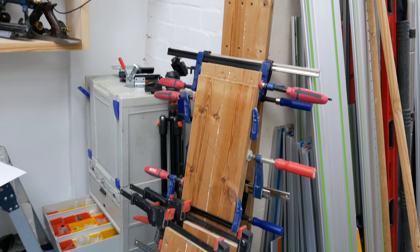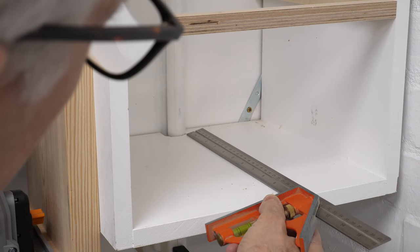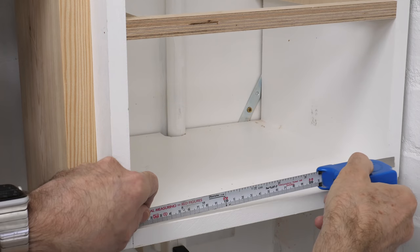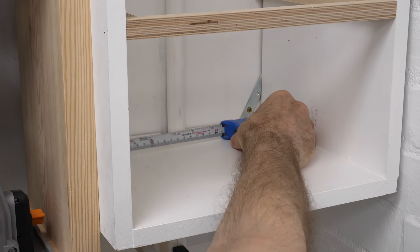Both cabinets fit around electricity - I've made an electrical conduit - so I've measured the available depth for each box and worked to the shortest measurement so the boxes won't sit proud. It's easy to add a stop to make the box front sit flush, but much harder to take a few millimetres off the back of the box.